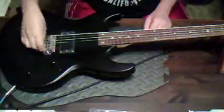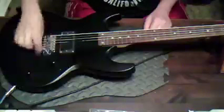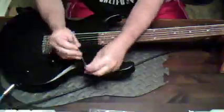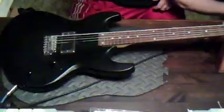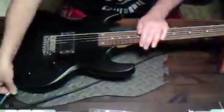I made this makeshift tremolo arm out of a piece of raw round stock. I threaded it with a die, and then I elbow bent it, and my last step is going to be to put a round chamfer on this end because it's really sharp, because I cut it off with a cutoff tool. So we'll act accordingly on that. I'll have to stop at some point and take that into my shop and chamfer that down.